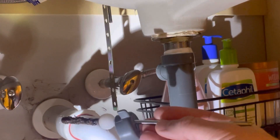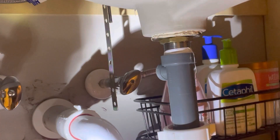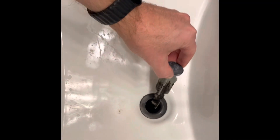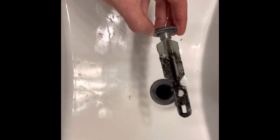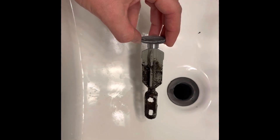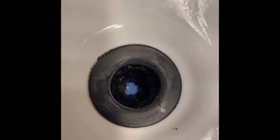This is the screw nut, the ball that's a seal, and then the metal interior — we'll clean that off as well. Once you come up to the top, this comes right out. It looks pretty dirty; we'll clean it off. A lot of times you pull it out and there's hair causing issues. You can look down through as well, and if you have a lot of hair gunking things up, you can take some plier tools and get that out.